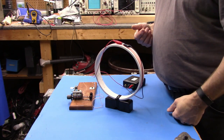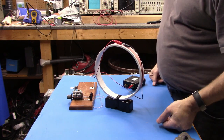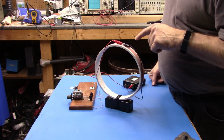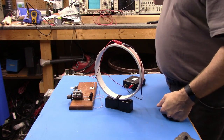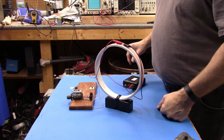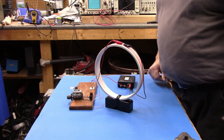We're going to extract signal out of that tuned loop with just this one turn of clip lead — actually two clip leads. This is typically how you extract signal: one resonating set of turns, and another one to extract power. I'll set up the laptop so we can take a look at what happens as I tune across.